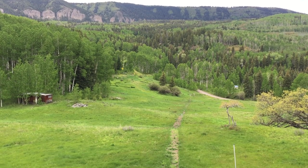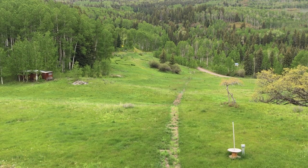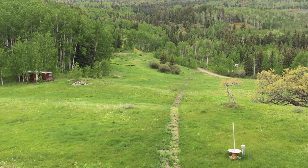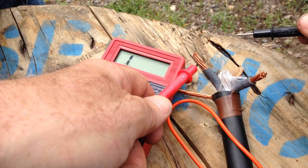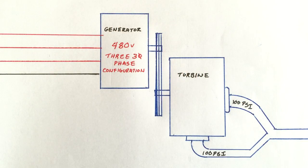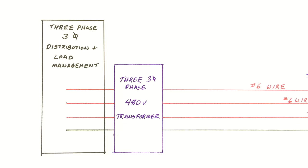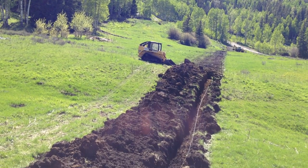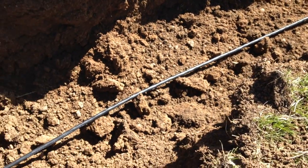The new configuration needs transmission to go nearly 1100 feet with a greatly increased amount of power. This means increased resistance and potential voltage drop. We have used direct burial number 6 gauge wires with three conductors and a number 10 gauge grounding wire. This can enable us at some point in the future to add a second water jet and transmit three-phase 480 volt power should the need arise. The greatest expense is in the burial of the wire, so planning for potential expanded future capacity was a logical choice.